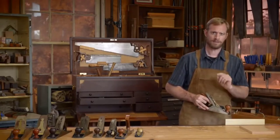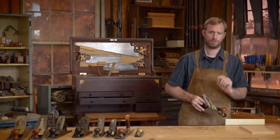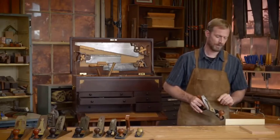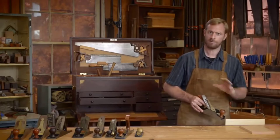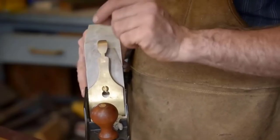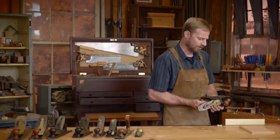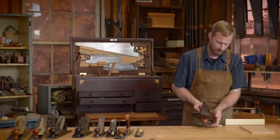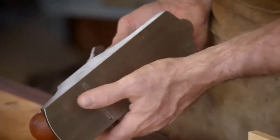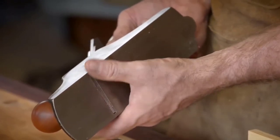Number one though, you've got to make sure the blade is razor sharp. Please refer to the video on sharpening a plane, because we go over the entire process of sharpening a plane iron. Extremely important that the blade is sharp. Now that we've got some depth, let's feel it with our thumb. What I'm doing is running my thumb across like this — if I ran to the side I'd slice my thumb, but running it across tells me the lateral adjustment is pretty good.